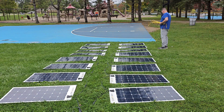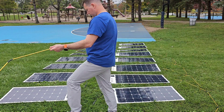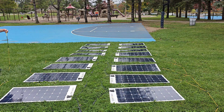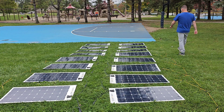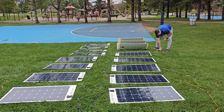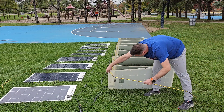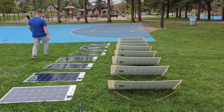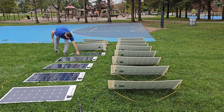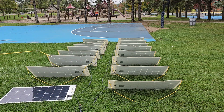I got a chance to lay out the panels. This is one of four strings, and putting the tent pole structures in the panels was actually not as bad as I thought — it went pretty smooth. This is eight down and eight back, 16 total, all connected in series. The tent pole is going real nice and quick. I'm not staking them here or anything — I'll just set it up and play it by ear. If it looks windy I might stake it, but if I don't have to, the grass keeps them pretty secure.